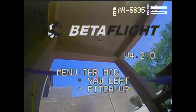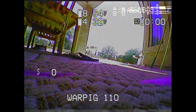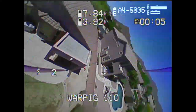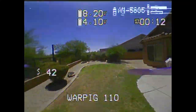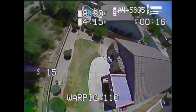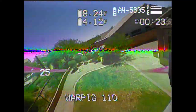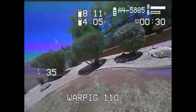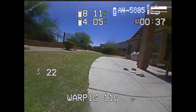On bigger quads they look a lot for throttle bobbles. As you're punching out you look for bobbles on throttle up - does it move around on you? Does it pop the nose, drop the nose, does it tilt to one side or start to spin? I'm not really noticing that here. But where I notice the low I the most is when I'm trying to come in for precision flying - it kind of doesn't want to hold its attitude as it's coming in. So let's put some I in there to fix that up.